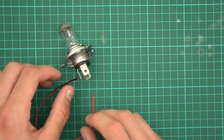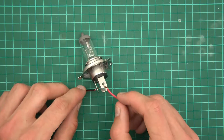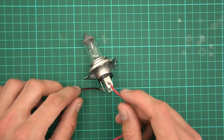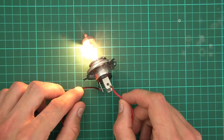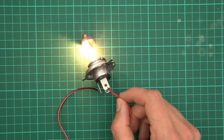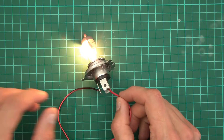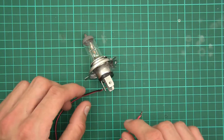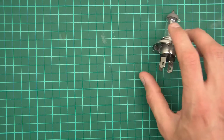I've had a look in my stock to see what I've got that's actually about 3 amps. It turns out this thing here is 3.2 amps — that would be ideal. It's an automotive bulb, and on the DC power supply it now says 12 volts and 3.2 amps. The middle one's ground, so that's 3.2 amps — I'll try it again now.